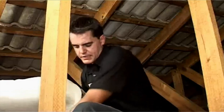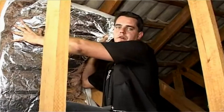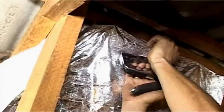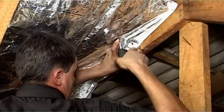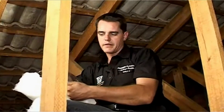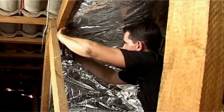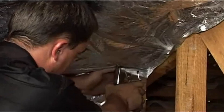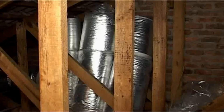It is done in exactly the same manner as the ceiling insulation, but using a staple gun — simply positioning the material in between the roof rafters and shooting the staple gun on the inside of the roof rafters. The foil is very strong, based with a woven polypropylene, so by stapling it onto the side of the roof rafter the material will stay in place for 15 years or more. Being an envirotough product, it's extremely strong and durable and won't tear over time.